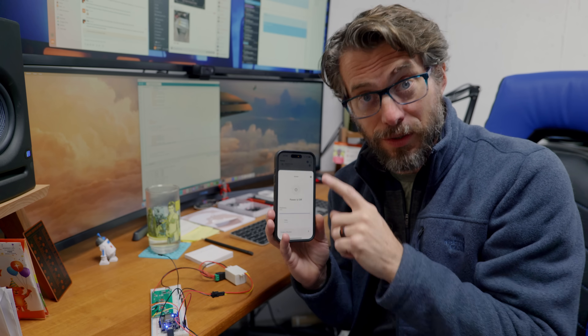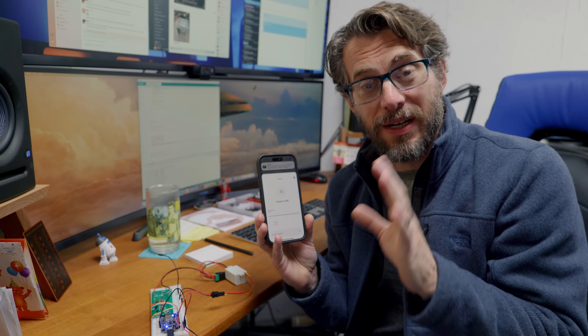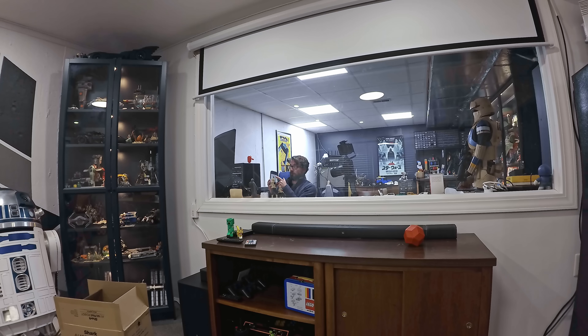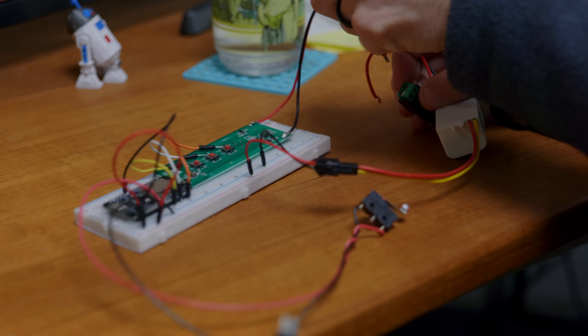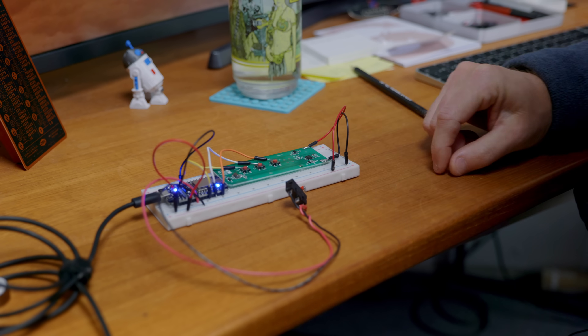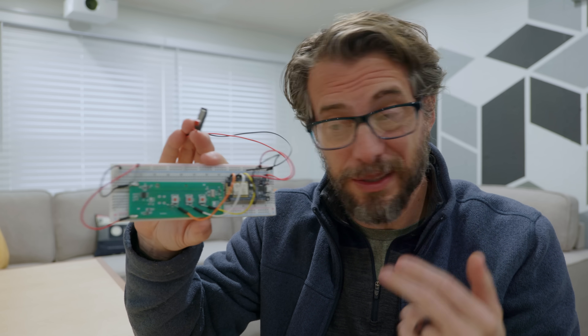I had my Amazon system detect the screen, and now it's one of my devices — and it totally works. I've got it set up so that if you power it on, it will bring the screen down, and if you power it off, it will take the screen up. The limit switch stops it in either direction, and that works — it's basically fully functional. I also accidentally discovered something cool: the remote doesn't actually need 12 volts. It worked just fine with 3.3 volts that came out of the Arduino, which means we can simplify the whole circuit and the whole thing can run off USB power. The electronics are pretty much done.